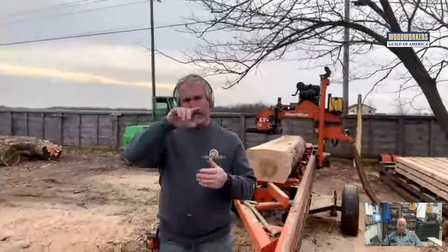If you're cutting a log to grade, or you're turning the log, trying to get the cleanest of cuts, you can scale it to get rid of that heart, or some people do use a term like boxing the heart. Well, they'll constantly be rotating the log to get even pressure off the log. And then they'll just get rid of that heart section. And leaving it in, I mean, that's the part that if people inadvertently leave that in, you're going to get a lot of checking and cracking around that, right?